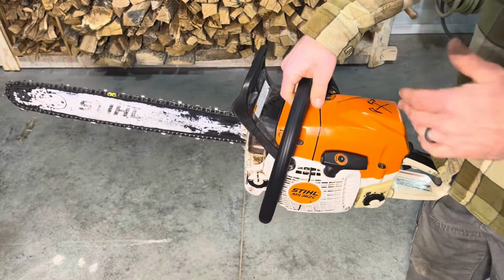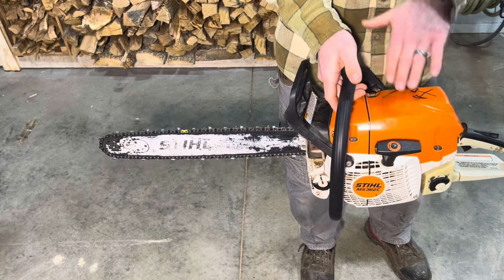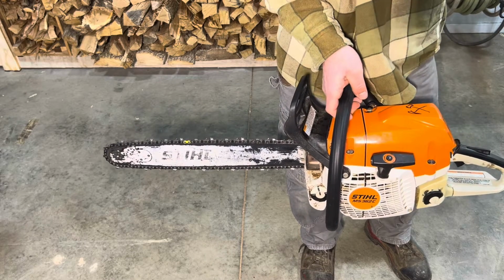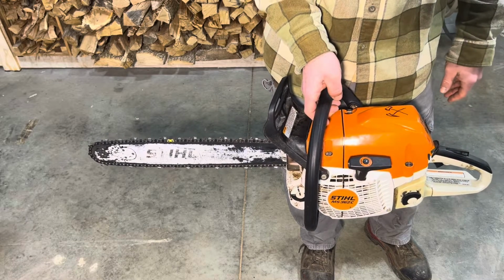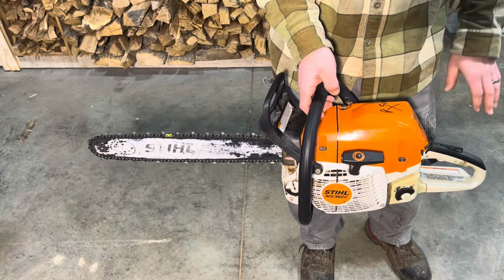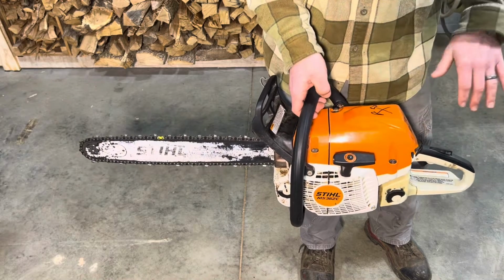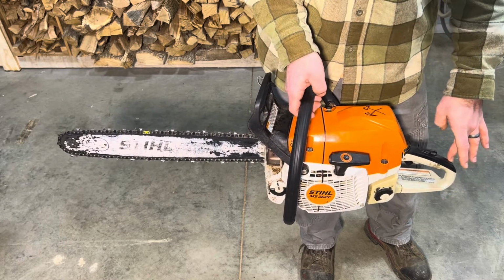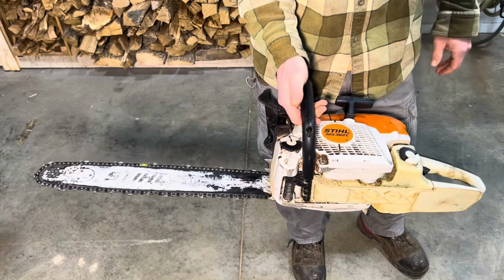felling cuts. So balance, I mean, hang on to the top side of your chainsaw and take a look at the orientation of it. If you can see this, the orientation as I'm holding it from the top portion of the front handle is that my bar is heavier and it's unbalanced from my power head. This bar is longer than the counteractive balance of the power head, which means that I will inherently have a tip down or a nose down of the bar if I'm just hanging on to it in this fashion, which means that if I want a perfectly horizontal cut, I have to know that I am bar heavy in this coordination of the chainsaw, to which I will always have to apply a slight pressure to the back handle to get that orientation horizontal.